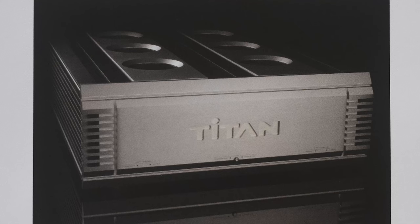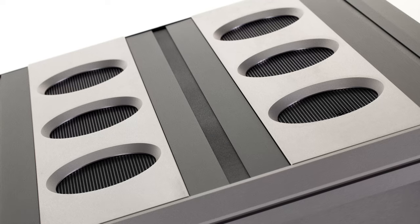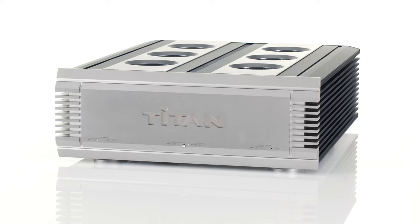We did the Titan as well, which came out just after the AMS — a sort of re-finding of the range. The Titan was a new Vista rehash, but we looked at how we could redo it. With the Titan, it was the first exploration into producing an amplifier which had its own bulk capacitance next to each output transistor, meaning there was an immediate store of energy right in the output stage, not somewhere back in the power supply, but actually right next to each transistor. So if it needs to pull a sudden amount of current to drive the speaker, the energy is readily available.